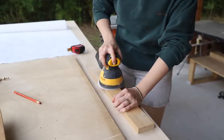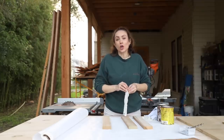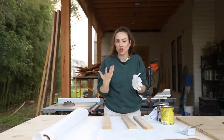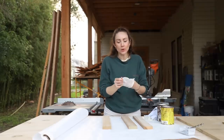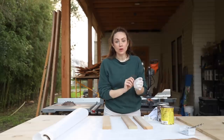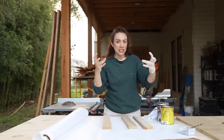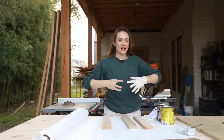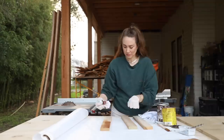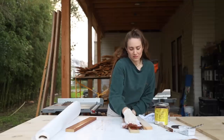Now we're gonna stain them. Same kind of combination that I've figured out is the closest that I'm ever gonna get to this older wood because it's aged for so many years. I go in with a layer of gunstock, which has a lot of orange, and then I go on top of it with a gel stain in mahogany, which has some red, but gel stain's so much thicker that it also allows it to have more oomph, so more color adherence. So I found that that combination looks really nice, and that's what I did on the box that's already in there.